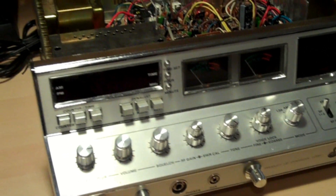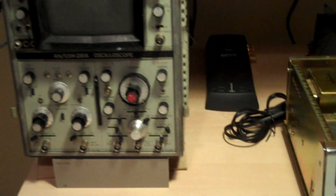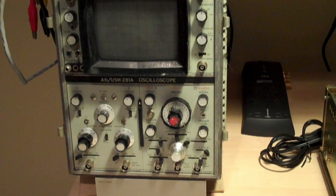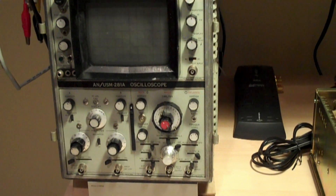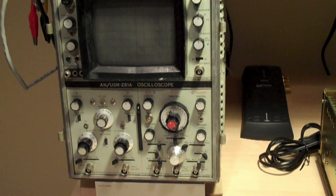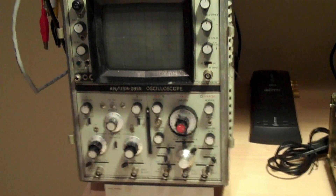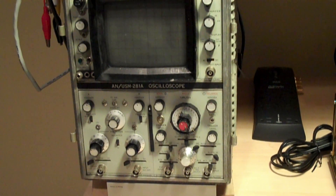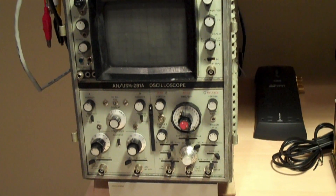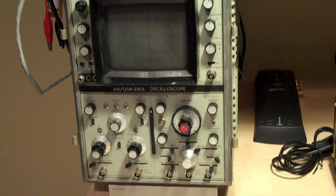So I'll show you what I've got — some basics you'll need. First off, you'll need an oscilloscope. This particular one was purchased pre-eBay. It's an HP, DC to 50 megahertz dual trace. Those are some of the basic specs that you're going to need for an oscilloscope, and for about $200 you should be able to get a respectable one.